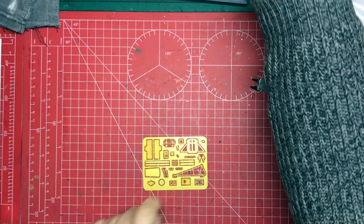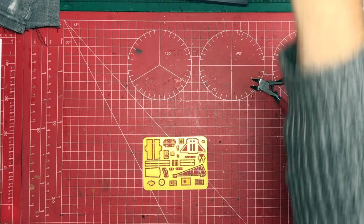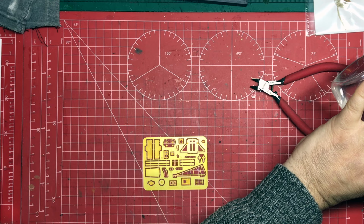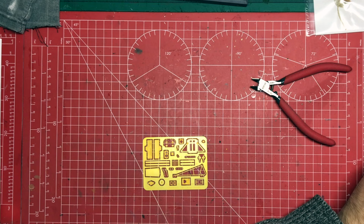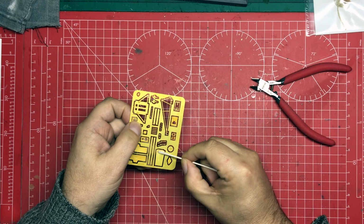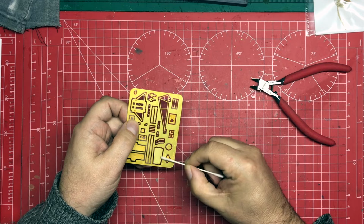And actually it does two things when you clean it with white vinegar. It degreases for a start, which is always a good place to be. But also it's slightly etching the metal, so it acts as a sort of pre-primer, if you like, and helps anything key to it. You can see some muck on this part here, and if we just rub it with the white vinegar, you can see how that cleans up. And then you can just leave it to flash off.